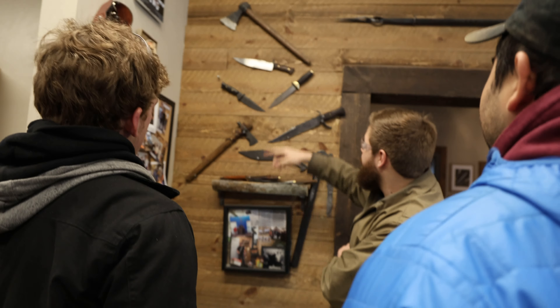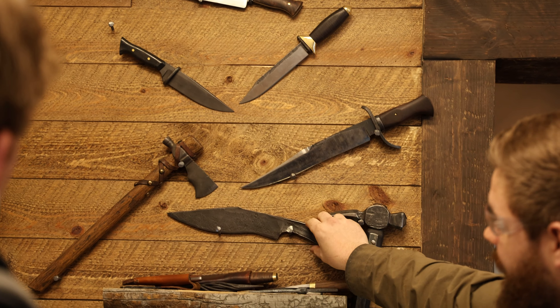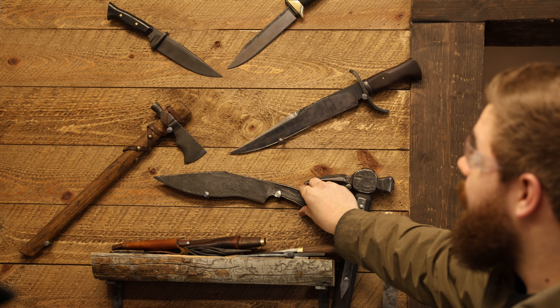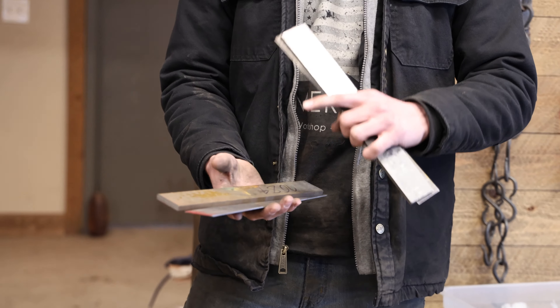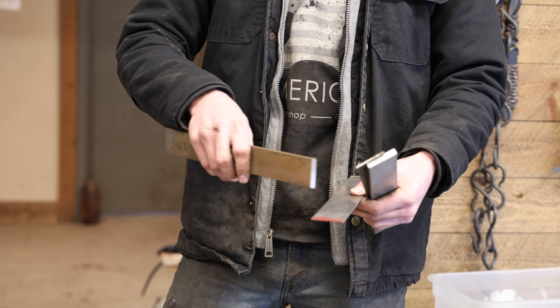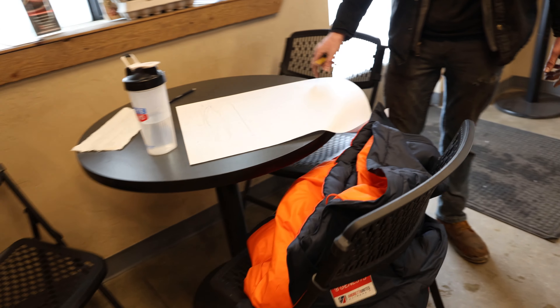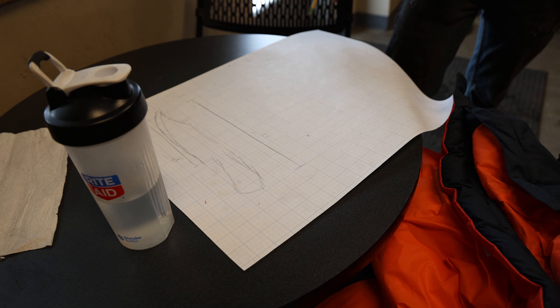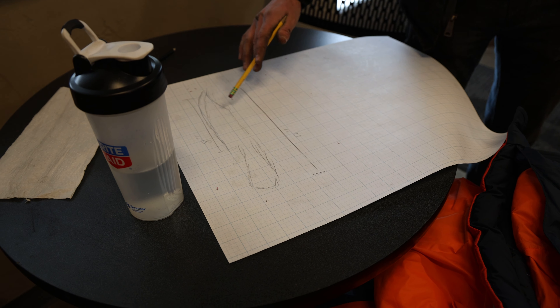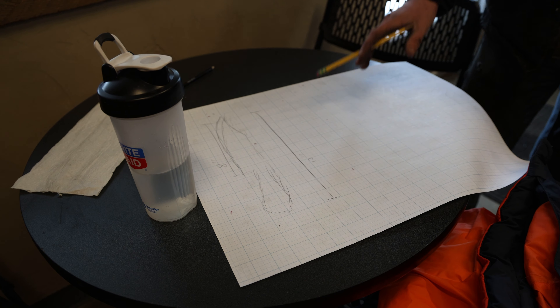After that brief overview of the day, it was time to pick what to make. If you want to do a lot of chopping, a recurved blade like that is good for chopping. Joey decided on a bowie knife and added a little extra challenge by making it pattern welded steel — a beginner's version at least. He's going to be stacking up small pieces of alternating types of steel, welding them together, and forging them. It's shaped pretty much like that — you'll see this point, slightly rounded edge, flat back, and then this hook thing in the back.